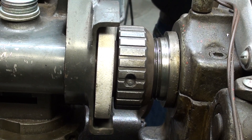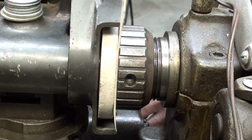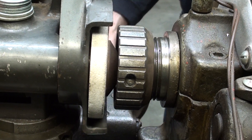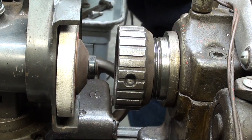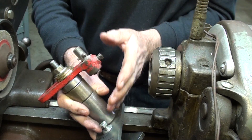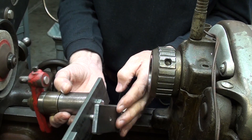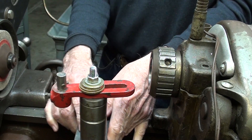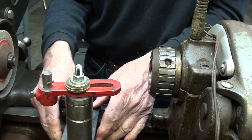I'm showing you this at a slightly different angle. If I put a card in here on this side — that's tight — and check it on the other side, I feel I have the same fit. Now I still have to dress the wheel, so I'll go ahead and reverse the thread protector, and it will stay on for the remainder of the operation. There has to be a way to hold the diamond dresser on here, at least temporarily — here's the diamond nib right here. I made this up several years ago for one of my other lathes, but modified it a little to fit this machine. It goes into this position and I'll tighten the bolt so it's sturdy and rigid.